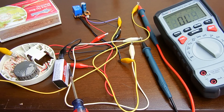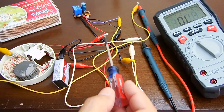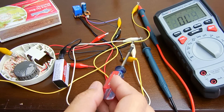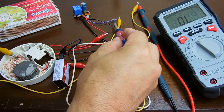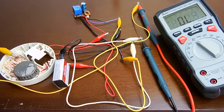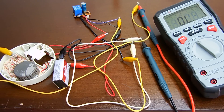Over here are the two relay outputs — the two black wires — and the positive 9 volts is the red wire. I'm going to take the red wire connected to the positive of the battery, the black to the negative, and the purple and connect it right where the voltage showed up at 4.5 volts. It's all connected up: the positive of the 9-volt battery connects to the red on the delay-off circuit, the negative to the black, and over here are your relay contacts connected to my digital meter on a continuity alarm setting. The input into the delay-off circuit is the purple going through the yellow wire to that point. Now I'm going to light a match, blow it out, and allow the smoke right next to this chamber so it's detected. I'll fast-forward through the roughly three-minute wait.